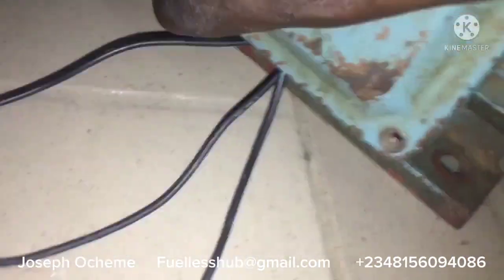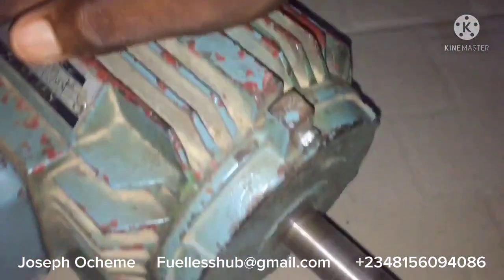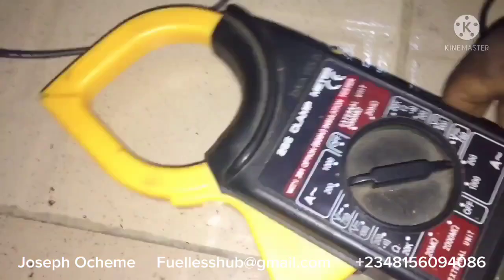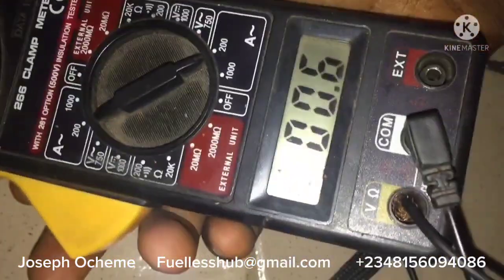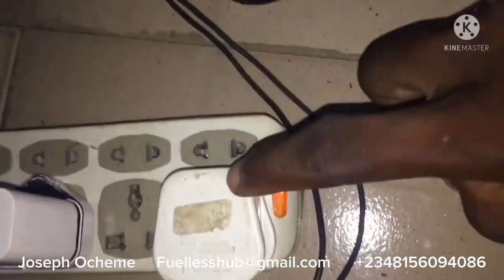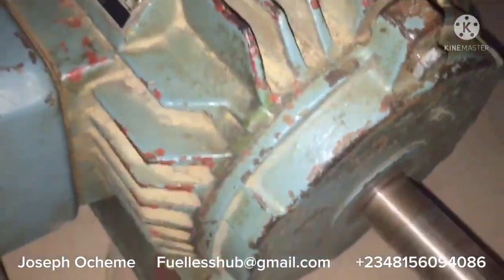You can see it is spinning on 220 volts at 2800 RPM. I'm going to take the amperage reading. Setting the meter to amps — as you can see it's reading only 0.5 amps from a 220-volt supply from an inverter. Here it shows 0.4 amps — so this electric motor on idle is consuming 0.4 amps.